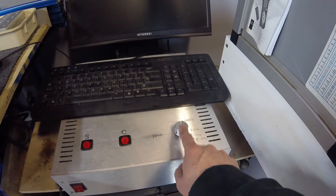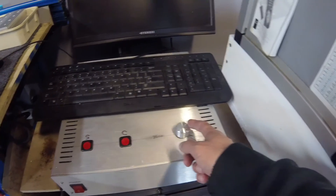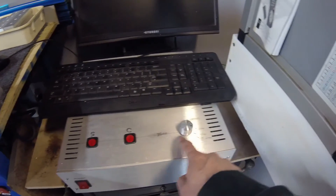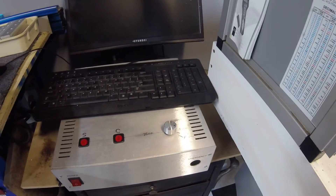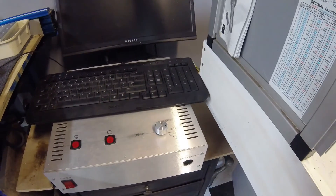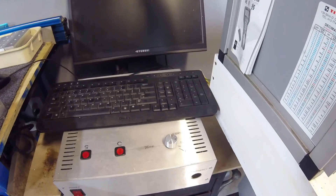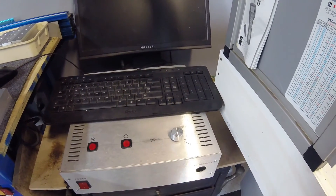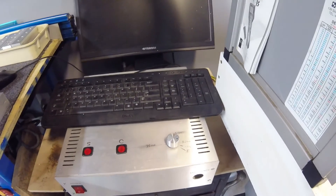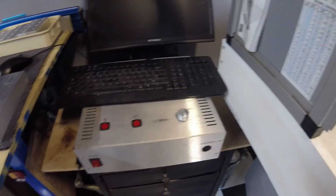This dial is how I control my speed now — from basically an edge finder at around 1200 RPM up to 8500 RPM. I've pencil-marked in different speeds. Normally I don't push it past 7500 because, even though the bearings can take it, there's no need to abuse it. At 7500 this little machine is fine — I'll use that for small drills and so on.